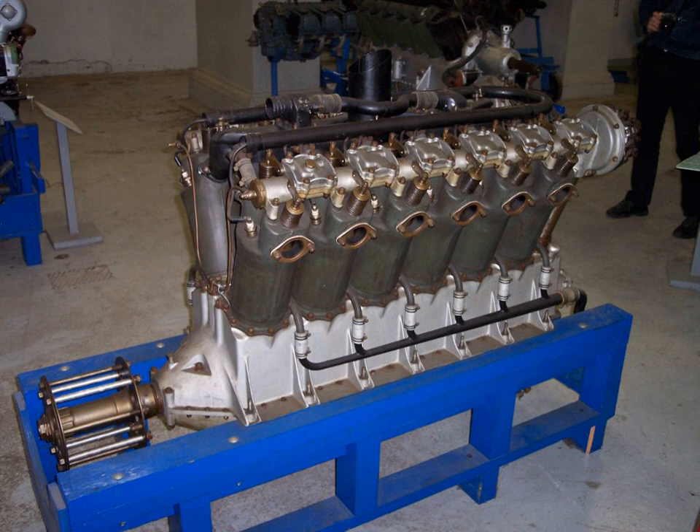Performance: 400 hp at 2,000 rpm takeoff; Specific power – 0.27 hp/cu in (12.4 kW per litre); Compression ratio – 5.4:1 for Army engines, 5:1 for Navy engines; Specific fuel consumption – 0.565 pt per horsepower per hour (0.43 L per kW per hour); Oil consumption – 0.0199 pt per horsepower per hour (0.0152 L per kW per hour); Power-to-weight ratio – 0.53 hp per pound (0.87 kW per kilogram).